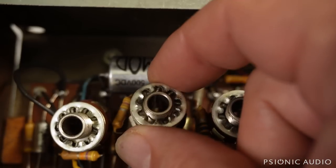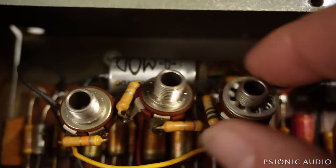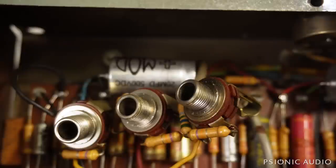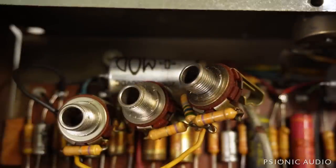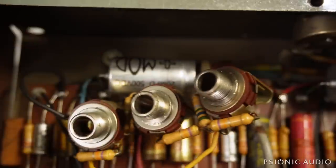You can see the little bits of crud and corrosion on these tooth washers — that's what makes contact for ground to the chassis. So all those are going to get cleaned off in a nice ultrasonic bath. As an experiment, let's take a little bit of paper towel with some isopropyl alcohol and give the inner surface of that chassis a wipe and see what comes off. This stuff cumulatively stands between your amp and good ground. The chassis surface and these contacts on the jacks will actually get cleaned with a little bit of DeOxit, to get really nice clean metal-to-metal contact throughout.